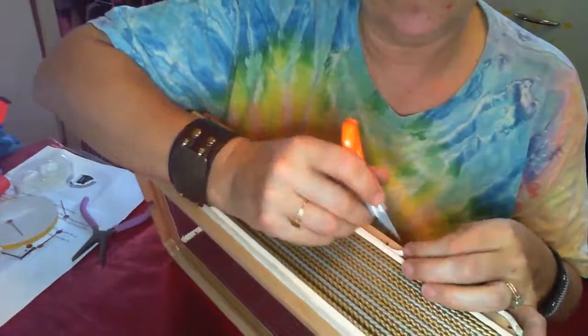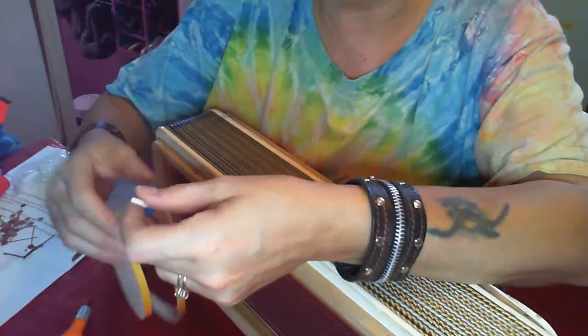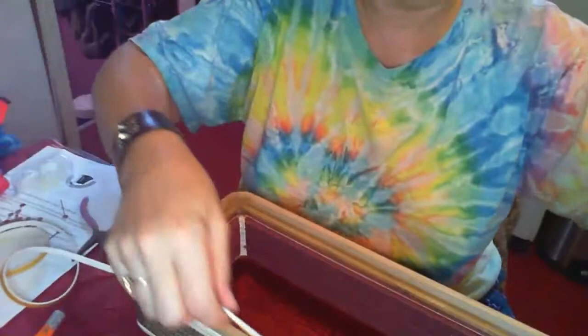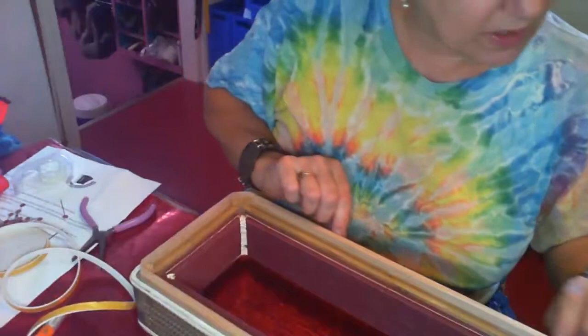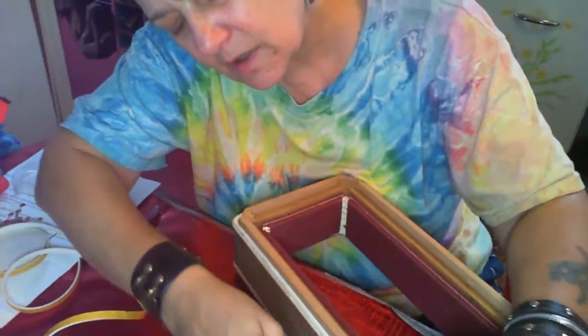And also, the gasket tape may be already pre-glued. Yeah. It's got this peel-and-stick. And because it's got the peel-and-stick, I can actually measure it thusly. Oh, good. Let's find out if I've got enough to do the whole thing. And where is the cut on this one? Is this a solid piece or does it have a join? Oh, yeah. And when you cut it at a diagonal, so the join is not a flush cut. That's right. I don't see any place where this existing gasket is joined. It's probably stamped out of a sheet of leather, not made off of a roll of tape.